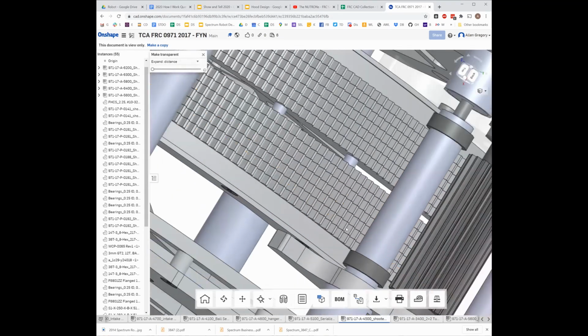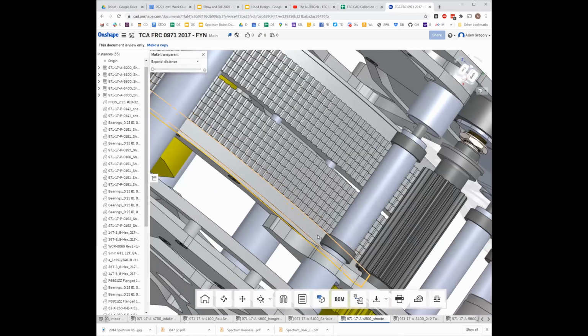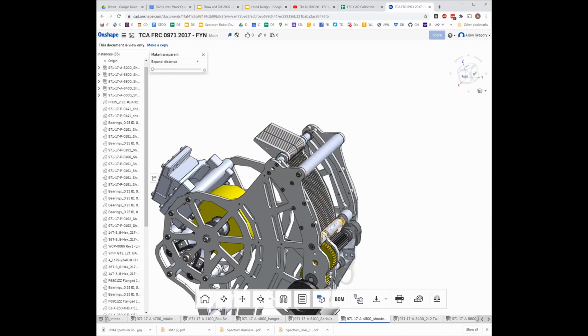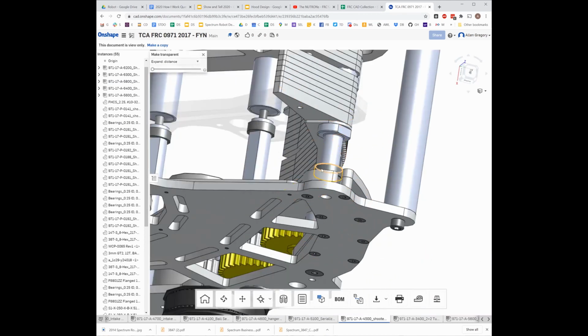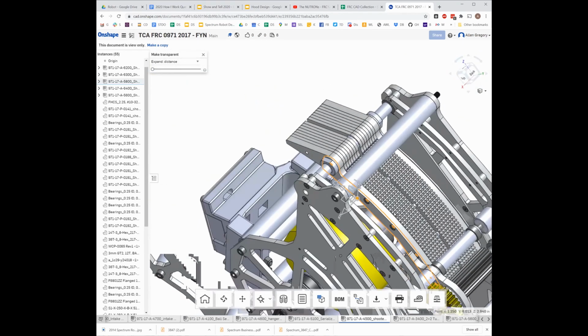And then there are also bearings riding on this outer back wall as well. These are flat, and there are bearings here as well. I've selected too many things. So yeah, these two dark gray things are bearings, so that as the ball is pushing on it, it can't be flexed backwards very much. It runs into these bearings and stops any flex going backwards. And the whole thing is relatively rigid, right? This is a pretty thick piece of material, all relatively solid. You're not going to flex those too easily once they're all bolted together.